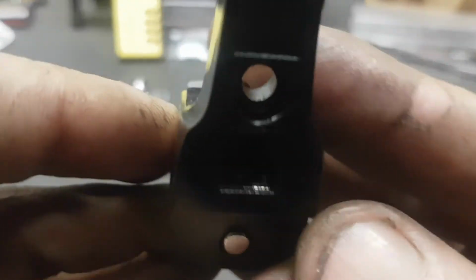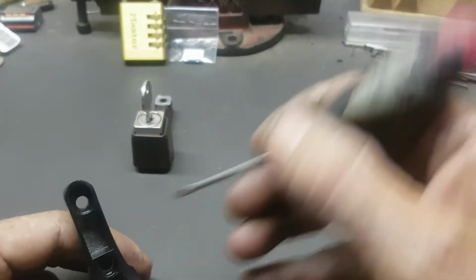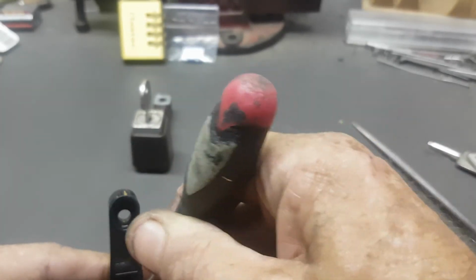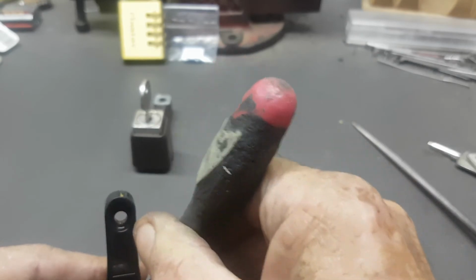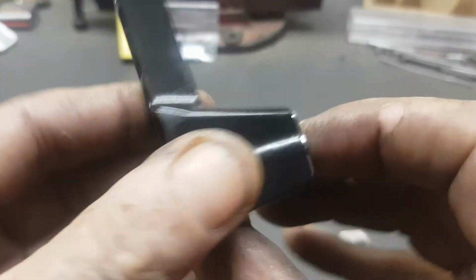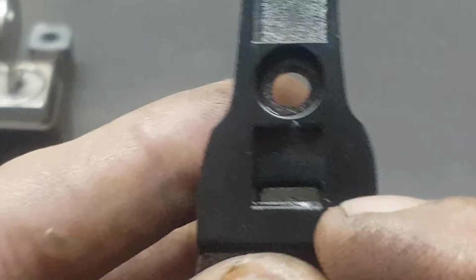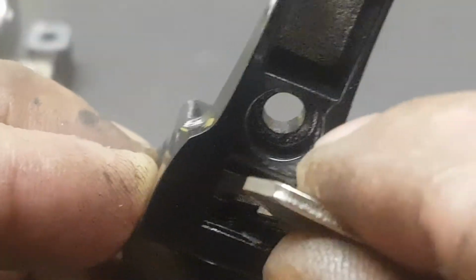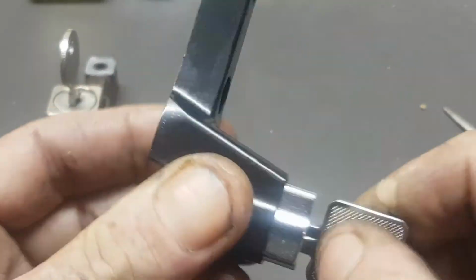So, although that spring is not right. That spring's got to be that spring at the back there. The spring's got to be perfectly straight, so the bottom of the spring goes into the little cavity inside. So just make sure the spring's dead straight when you push it in. If you have trouble with getting it right in, you'll see the spring's a bit wonky. Just get a screwdriver in there and sort of line her up. And yeah, get your working key. And yeah, Bob's your uncle.